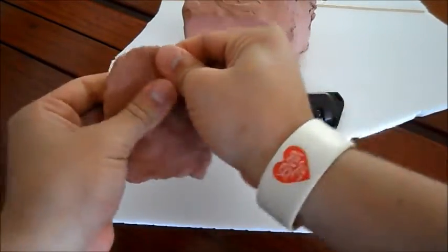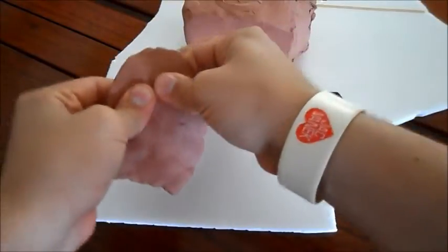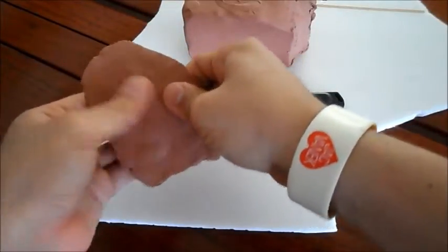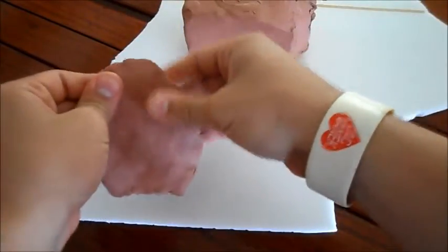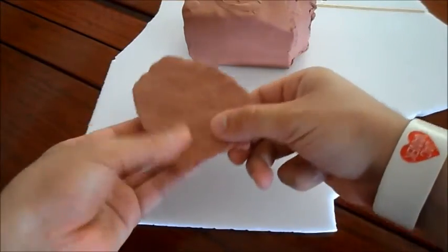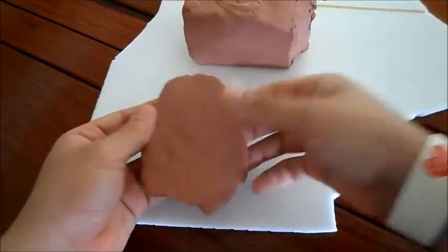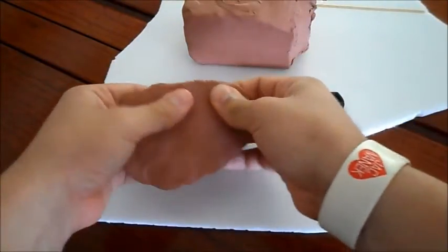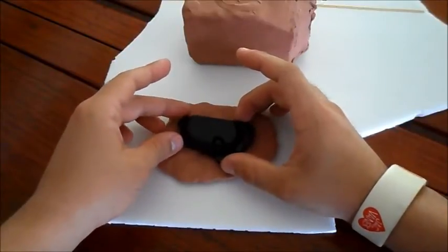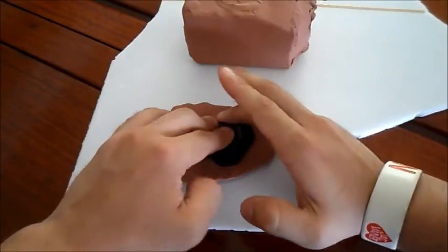Once I have the clay ready to press the piece into, the next thing to think about is how you're going to make sure that the two halves line up. What you're going to have to do is make some registration points. This is very easy to do in clay because you can just carve grooves into it. That way, when you pour the silicone in and it sets, it will run into these grooves that you carve in, and it'll have bumps and raised areas that you can make the other half register to. That helps you keep the seam lines nice and tight and makes sure there's no warping in the final piece. So I've spread that out nicely now, and I'll just press that in slightly, to make sure the silicone doesn't get underneath the piece itself.